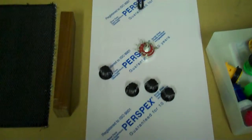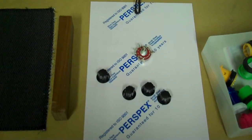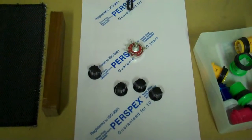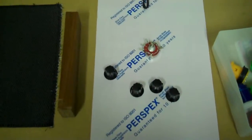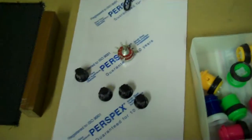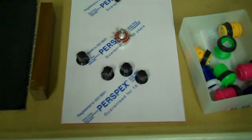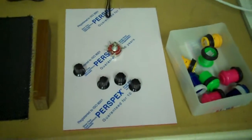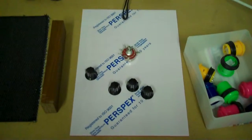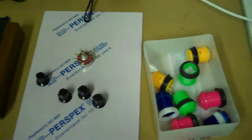The perspex isn't cheap but it isn't expensive either — it's worth spending five pounds to do a prototype rather than just building diagrams on paper. The best approach is to get the buttons, place them on, mark them out, and have a feel for the material — see what it's like to drill, and whether I need thicker perspex for extra strength. That's all part of the process and development — if you want to make a better product you need to test everything first.